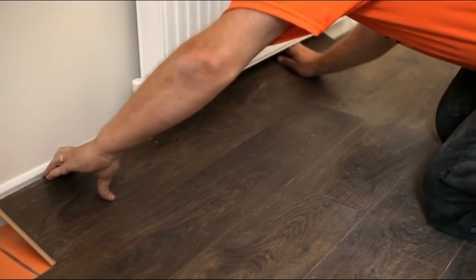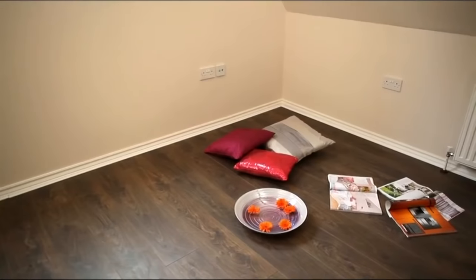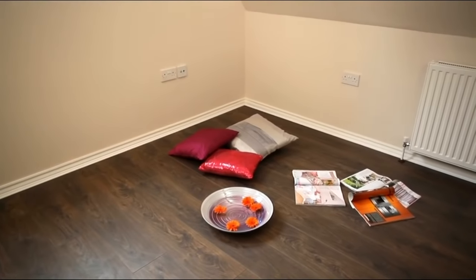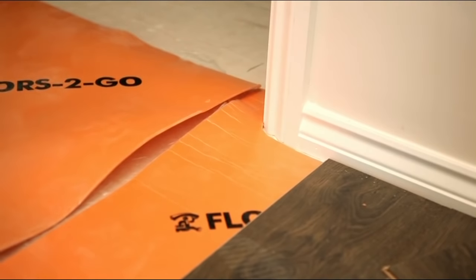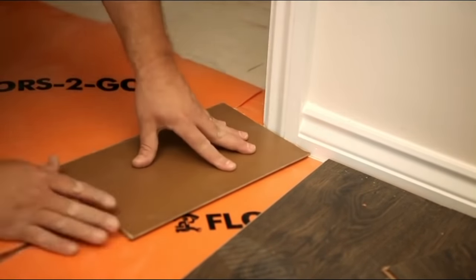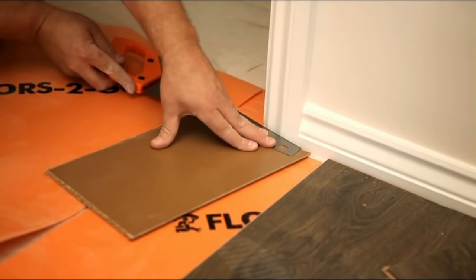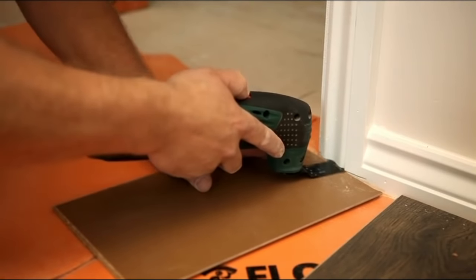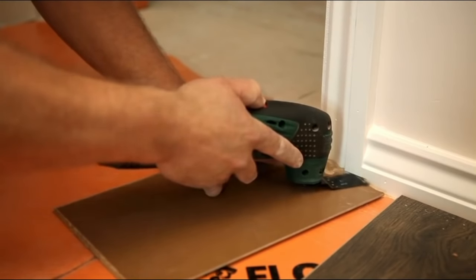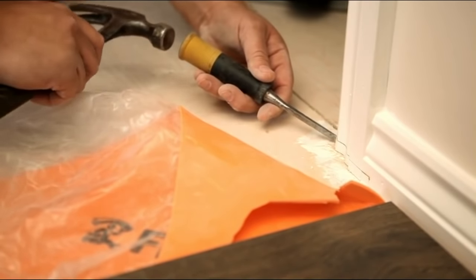So that's it. All you need to do now is watch our 'How to Fit Skirting and Scotia' video to find out how to finish it all off. And before you go, here's a very handy tip for getting around door frames. Get an offcut of the flooring and lay it flat on the floor next to the door surround. Lay a hand saw onto the piece of flooring and cut horizontally into the door surround until you can chisel it out. Alternatively, you can use an electric chisel, which is a lot easier. This technique gives you a great finish around doors.